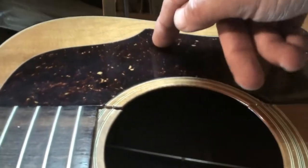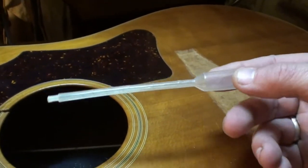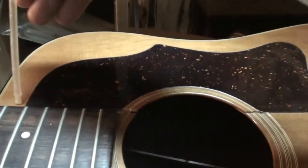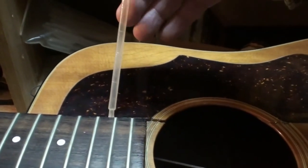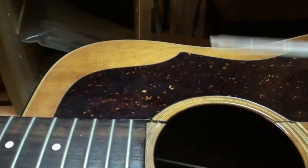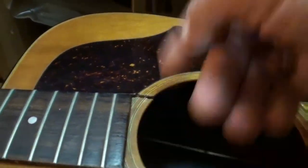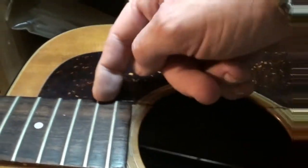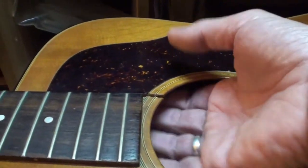What I'm going to do is use this pipette — I'll crimp the end of it, fill it up with glue, hold it against the crack, squeeze it, and force glue into the crack. Just shove it in, make it go down in there. This side of the top has pulled away from two braces right here, and if I can get enough glue down in there it should run right where those braces are.